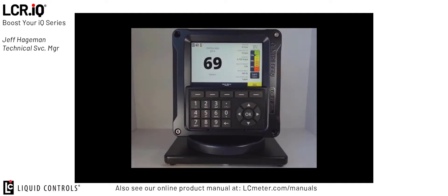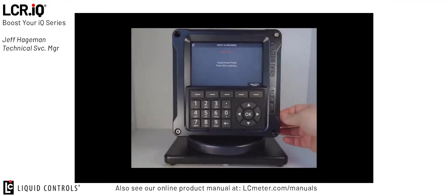To begin the process of setting up the Deadman control feature, we first need to put the IQ register in the calibration position. Locate the bolt on the side of the register and rotate it counterclockwise about six turns. If you have a printer connected to your register, at this point it will print a calibration ticket. I don't have a printer connected, so I'll press the abort print button.